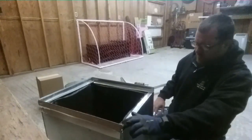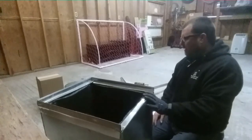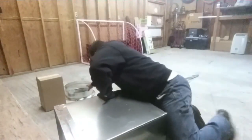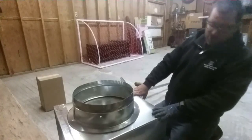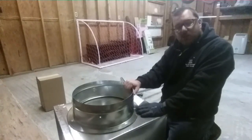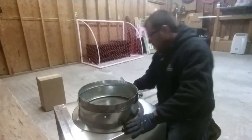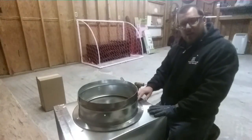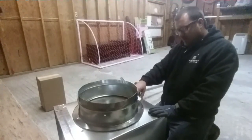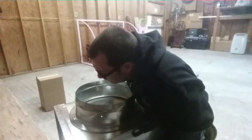Okay guys, I'll tape over the top tray. I'll tape over the front and the filter door when I have it in place. Off the back side we're going to have a return duct. I'm going to cut the hole but not put the collar in yet — reason being if I put the collar in, it won't fit into the pull-down staircase. I'll just cut the hole and have it ready, so as soon as we get up there we just slap the collar on. There's a drain pan, so I want to stay a few inches over the top. The drain pan is going to be about an inch and a half to two inches tall, so I'll stay above that — about one inch below the top.